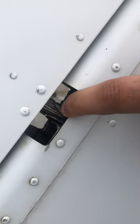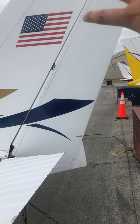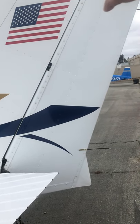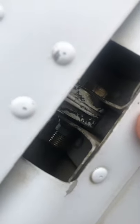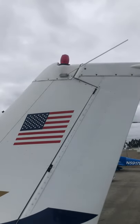This bolt is all that's really holding on this entire rudder. I remember about eight or nine years ago, before I owned a flight school, I was helping one of my mentors repair his rudder — I was like, wow, that's all that holds the rudder on. So if you're ever going to check something, check that bolt, make sure it's on securely. That's what's holding on your rudder.